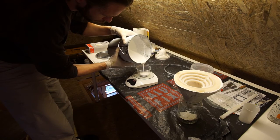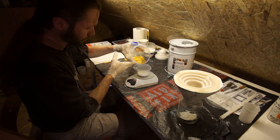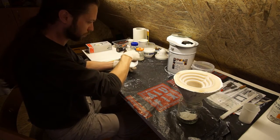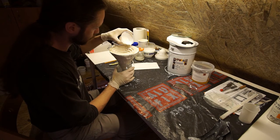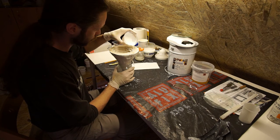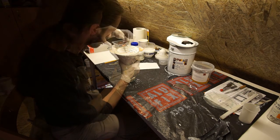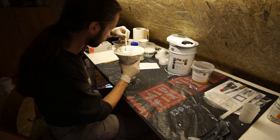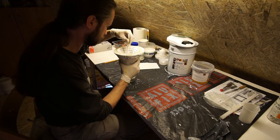I'm using a fast casting polyurethane resin. It consists of two components which have to be measured precisely and stirred properly. After mixing the components I have three minutes to apply the material, so I have to be time effective and precise. The material should be dispensed carefully into the small details because in the deep parts air bubbles can easily remain.